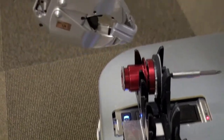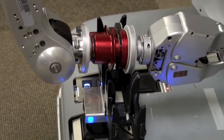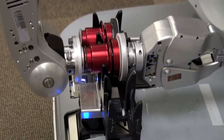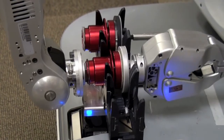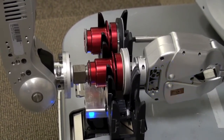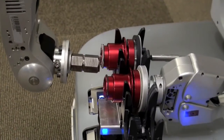Normally what happens is the robot will have this set of end effectors mounted on the robot somewhere. The arm will come by and dock with one end effector. When it docks, it'll actually release the end effector so the arm can come out and then dock with another end effector.